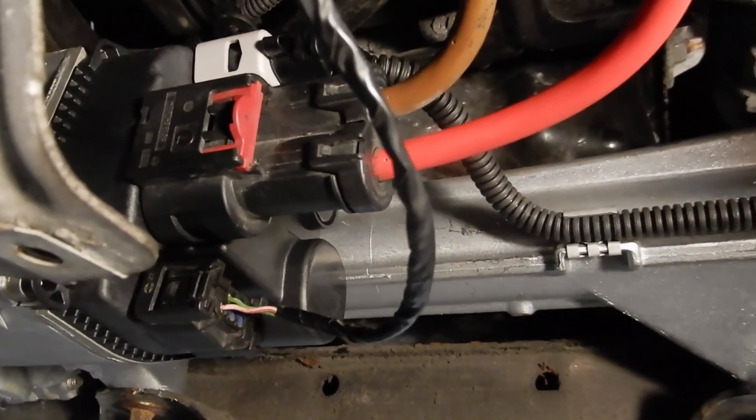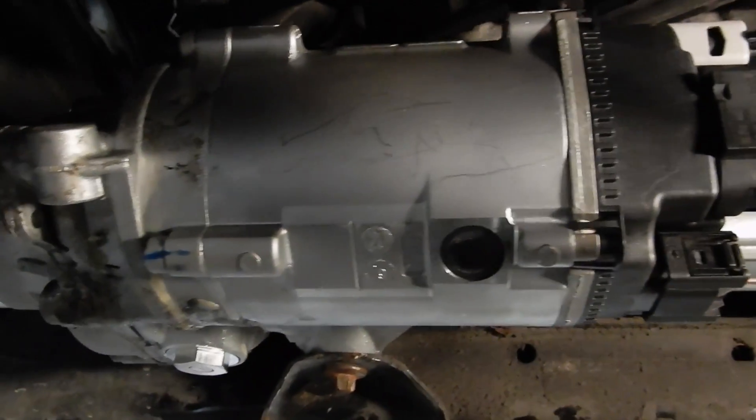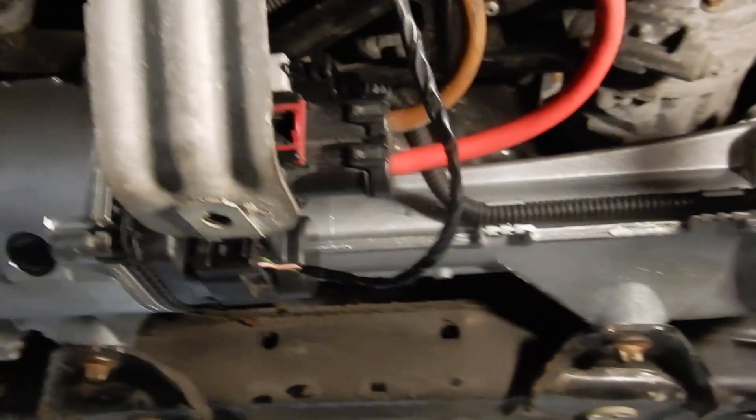Be careful on the 1 Series F20 models — always check the ground wire bolted to the chassis for your electronic power steering. To summarize: a NOCOM with the power steering module on this BMW was caused by high voltage on the FlexRay communication wires, which was caused by a bad ground on the power steering motor.